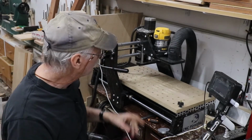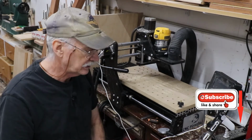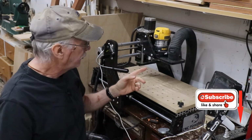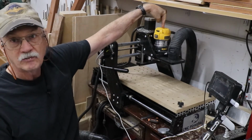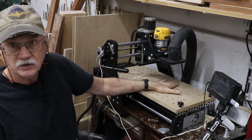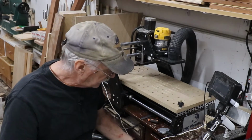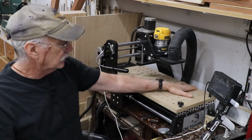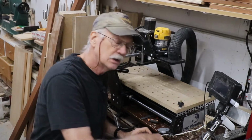A few months ago, I noticed that the CNC router and table were not really perpendicular to each other. So I did a little bit of Googling and it said it needed to be trammed. I'm new to CNC. What tramming means, basically, is you're going to make the cutting axis of the router absolutely perpendicular to your cutting surface on your table. The first thing you do is get that straight. Then you take a surfacing bit, run a surfacing toolpath over your spoil board, and that makes that perpendicular to the router.